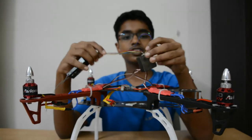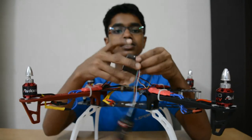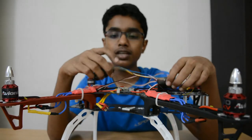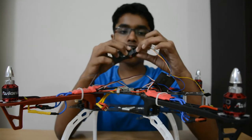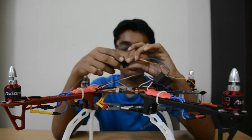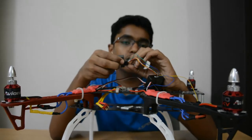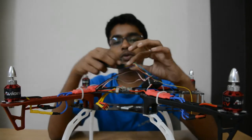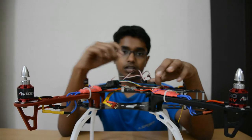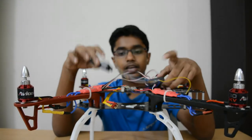Yeah, so now if you can see here, these two pins are coming out at the end. Always start from the black pin. So the first is going to be your black pin. The black pin, red pin, and the yellow or white pin are all going to be in the same row. So that should always go to channel number 3. The blue pin should go to channel number 1. Yellow pin, channel number 2. And green pin, channel number 3. I guess that's right. If I'm wrong, I'll put the link in the description below to tell you that I'm wrong. And then you got to mount it.